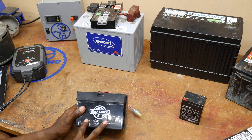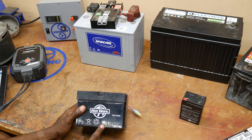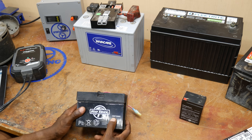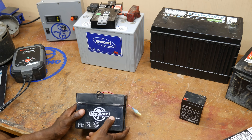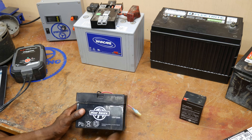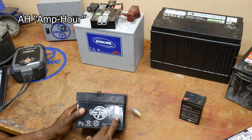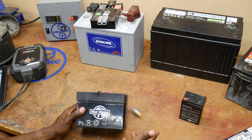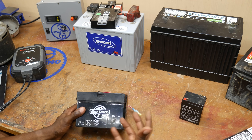Here we have a battery taken out of one of those Power Wheels kids' cars. You can see a number on the front: 12V is pretty obvious — it's 12 volts — but 12AH may be new to you. It stands for amp hours, meaning this battery can put out 12 amps for one hour, or one amp for 12 hours, or two amps for six hours, and so on. This just gives you a relative scale.